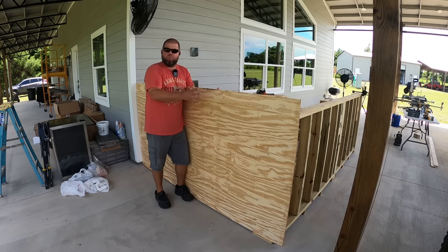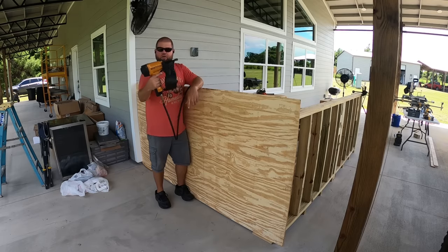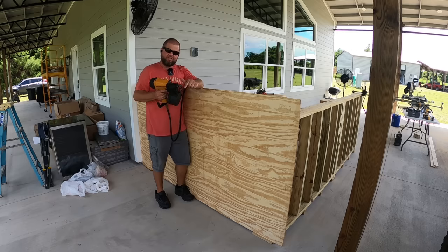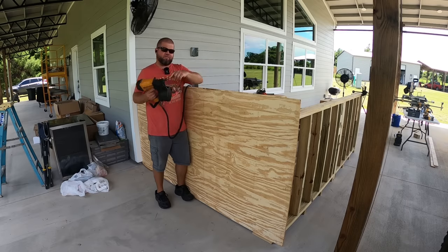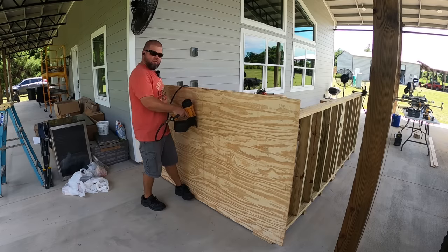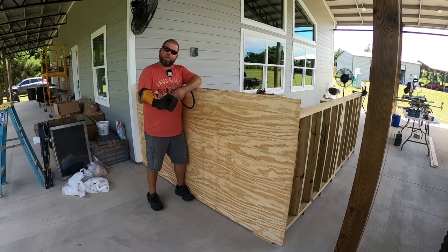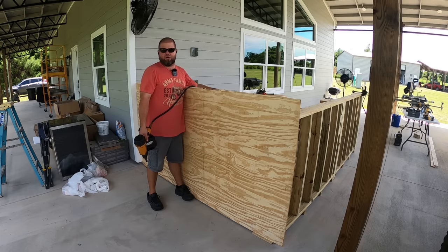I actually have a big deer blind that's been sitting out for a few years in the woods with paneling similar to this, with a good coat of paint on it — no rot, no issues — and it's been through every storm, tropical storms, hurricanes, everything. It gets wet all the time. So you really want to seal the wood good and do multiple coats of paint and we won't have a problem. To put all this on I'm using my Bostitch siding nailer — a coil nailer that shoots a small two-and-a-half-inch ring-shank galvanized nail. When they go in, they stay in. I've set the air pressure up to overdrive the nail just a little because I want to come back and fill all the nail holes with wood putty, quickly sand them down with my orbital sander, and then paint — so you don't see any nail heads. I ripped down some half-inch wood spacers to space the paneling a half inch off the ground so air can get underneath because water is going to make its way under there between pressure washing and rain.